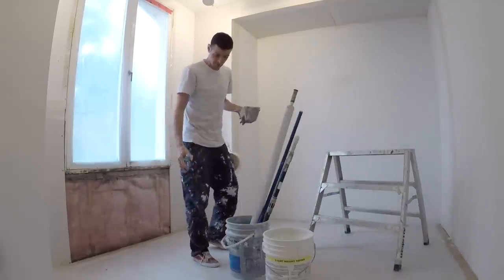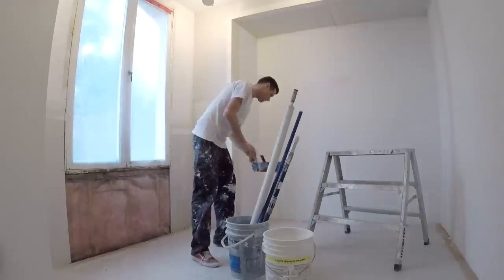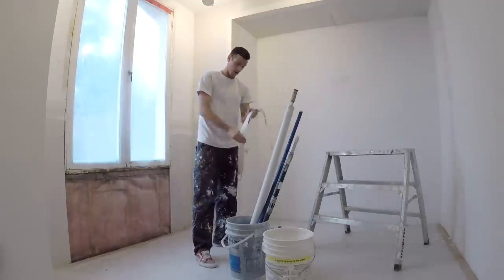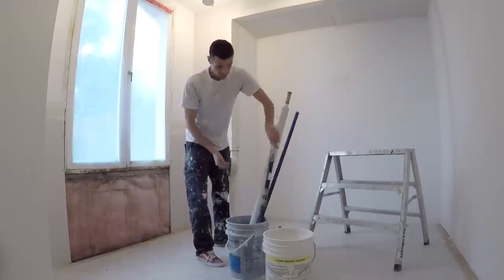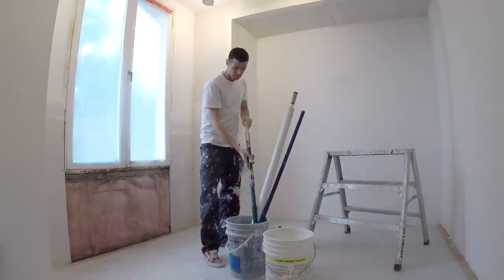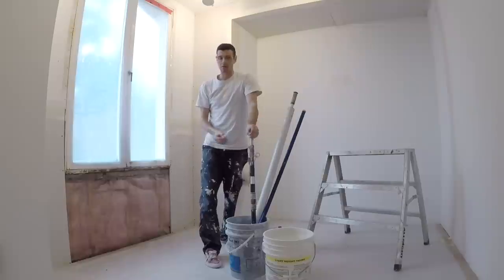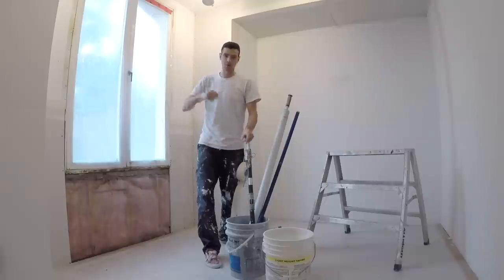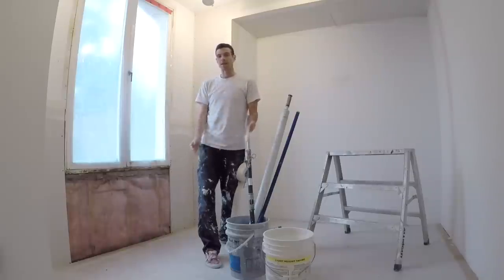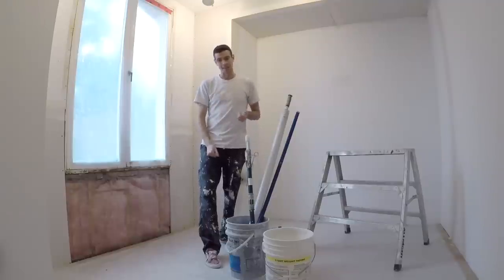Forgive the crinkly noise — there's plastic all over the floor. I've got my four inch knife and pan, I've got a tape spool tucked into my pocket, I've got the tube roller and we are going to start with the three inch flusher today. Most of the time I use my super taper and just apply the wet sloppy tape into the corner and go over it with the two and a half inch. It comes out adequate and it's very fast. But this video we're going to be doing the best practices so I can show you the best results that this system can give.